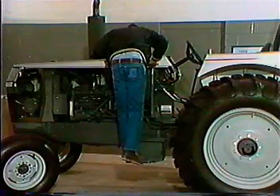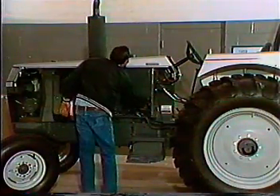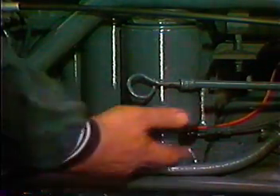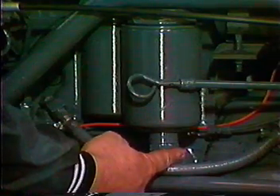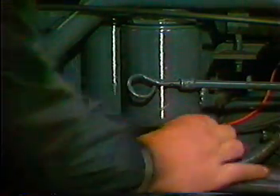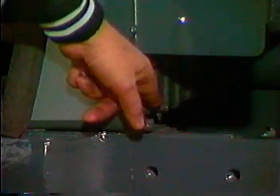The fuel tank should be approximately half full and the tank valve in the full open position. Fuel filters are located here and should be hand tight. The primary filter is the longer of the two and has a water trap built into the bottom. Open the drain to allow any accumulated water to flow out. The drain point for the coolant system is here, and the drain should be hand tight.